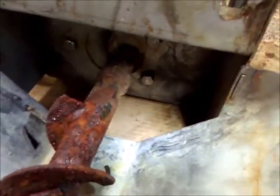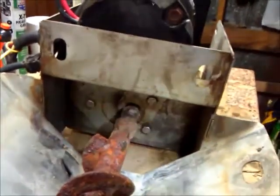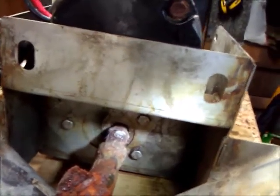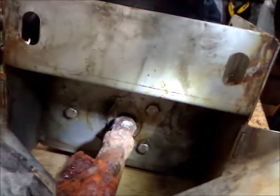On the other side I've already tried to work on this — you'll see I've ground off the side that came through in an attempt to pound it through the other side. I flipped this whole unit upside down because you can access it pretty easily from the bottom, and you can even do this on the truck without taking the whole auger mechanism off. But it's cold outside so I brought it all inside to work on the bench. Since this is not coming out, I've used all the normal techniques: PB Blaster to loosen it, a torch to heat it, and a drift pin to pound on it — but the pin is not budging.